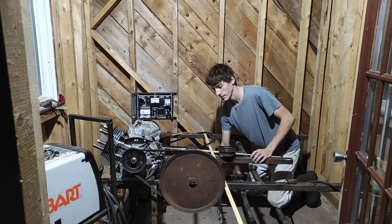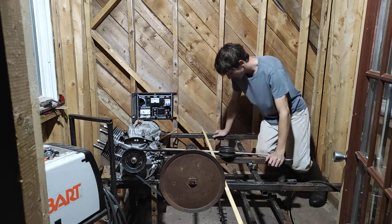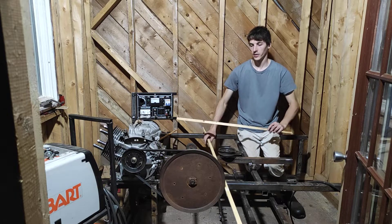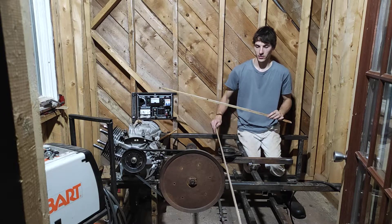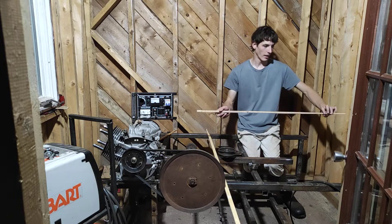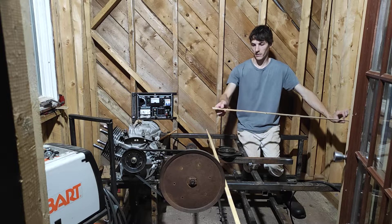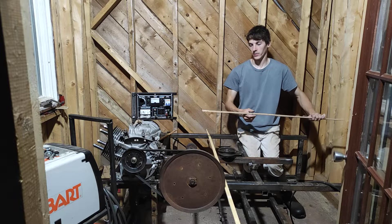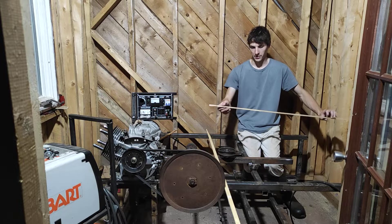Your output is not rotational, unfortunately. You have two outputs — you don't have to use all of them. You have this one going back and forth, and this one going back and forth. You can replace these with a long pivot so it's very close to straight, because a pivot is so much better, easier, and cheaper than a slider. Sliders are bad news.